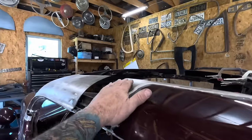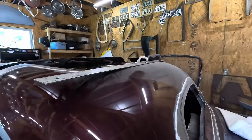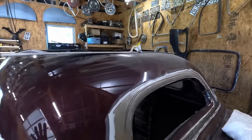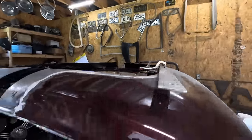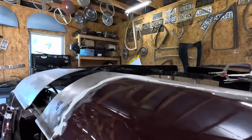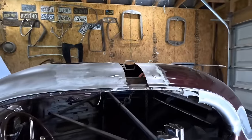Last time we noticed these two surfaces no longer lined up. I figured out there was a weird arch in the center, just misshaping from aligning the sides. I went ahead and put a little weight on there with my chain fall, just enough to give it a tweak, and as you can see that actually lines things up quite well. I'll build this filler piece and then move on to the B-pillars.